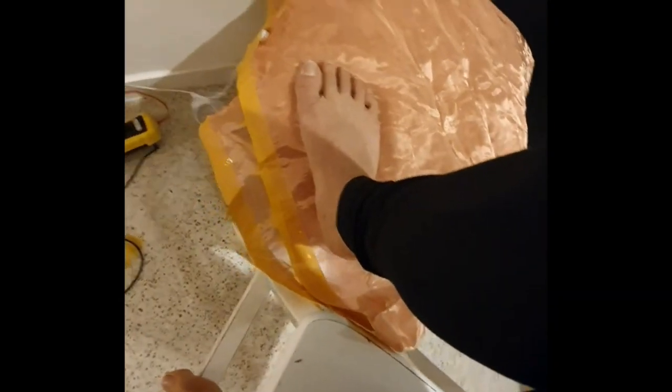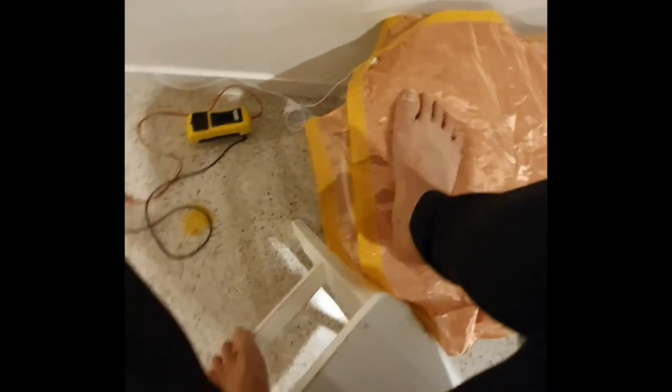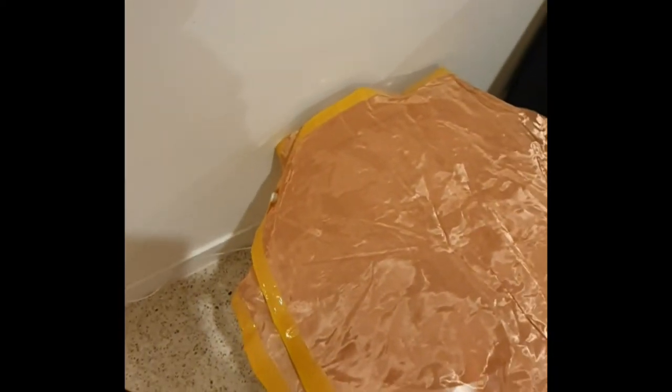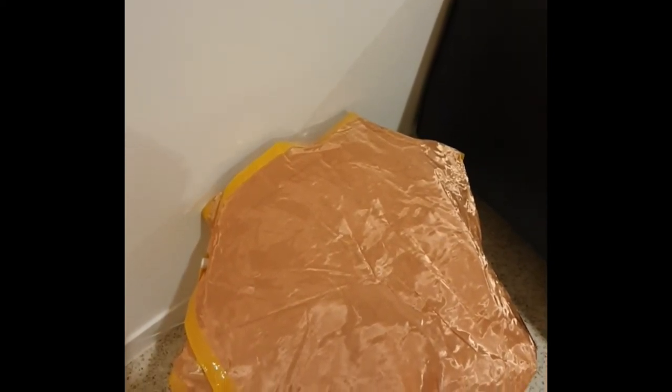Very simple: attach a wire, make sure anything that contacts electricity touches the mat, and connect it to the earth pin. When you touch the mat, it goes from five volts down to 0.09 volts — pretty effective, and I'm only touching it with one foot. You don't have to use copper mesh; any metal will work. Aluminium mesh would be a really cheap option and it also conducts electricity very well.